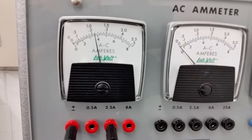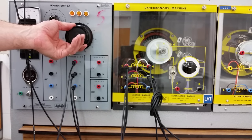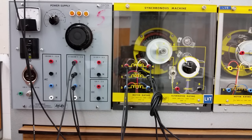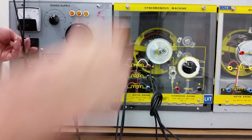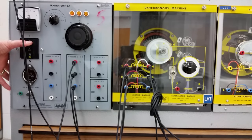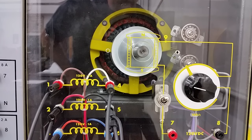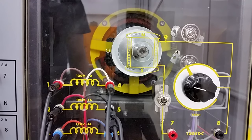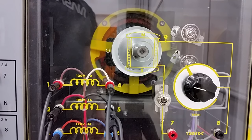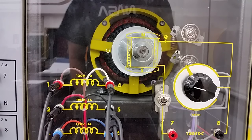If we give it full voltage and then turn it off, we can see the motor turning clockwise. Since this is a three-phase machine, all I have to do is interchange any two of the windings and the motor goes counterclockwise. Reversing this motor is simply just changing any two phases — it has the exact same stator as an induction motor or a wound rotor motor.